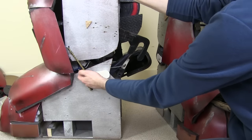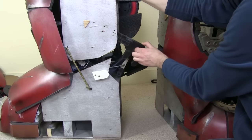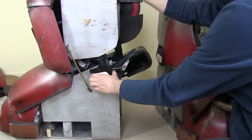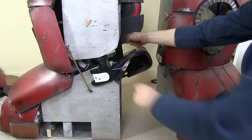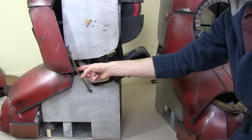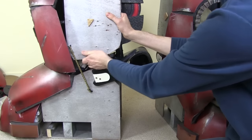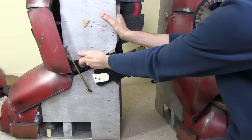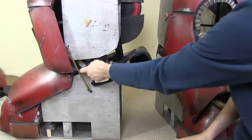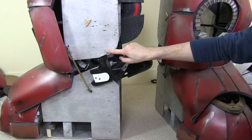In the previous testing video where I tested without the arms they were really good, but what actually happened is that the inside ankle lock was still done up and only the other side was undone. That's why I put these bungees on so I can still be flexible on the inside but have something tying it in to stop the movement sideways. However bungees are quite springy so it didn't work. So what I really want to do is put a rigid link on this side.